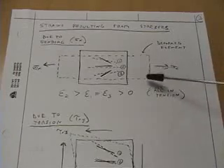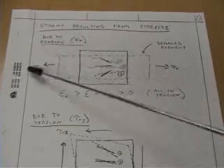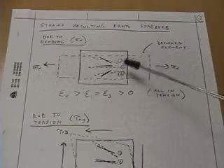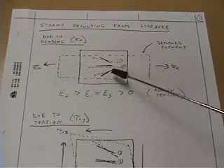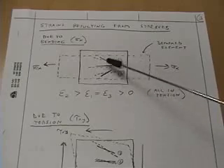These figures show a qualitative analysis of the strain being experienced by the rosette, showing the effects due to bending. When an original element of material is stretched in the axial direction, this dashed rectangle illustrates in an exaggerated way how the material deforms. The central gauge will be in tension and will be stretched the most, and the other two gauges will also be stretched slightly.